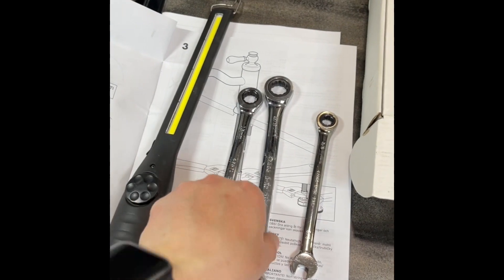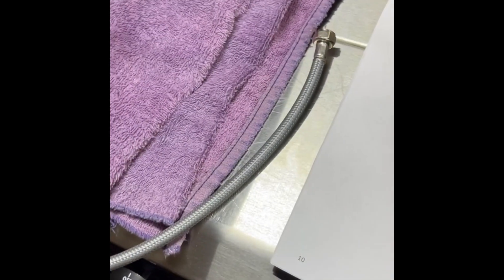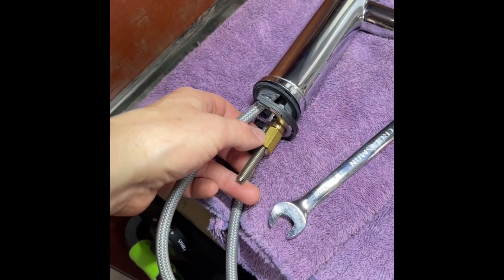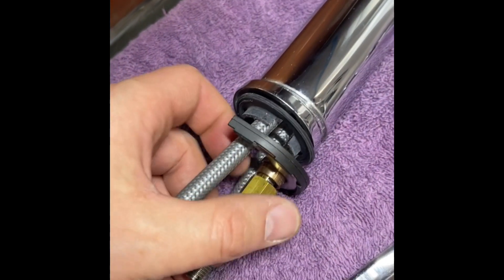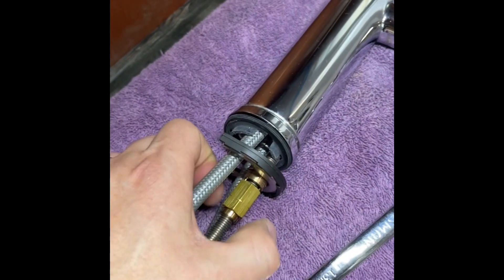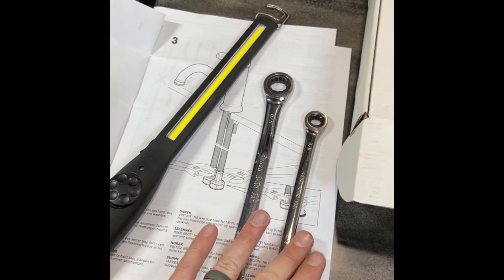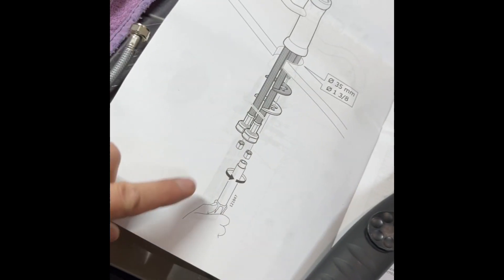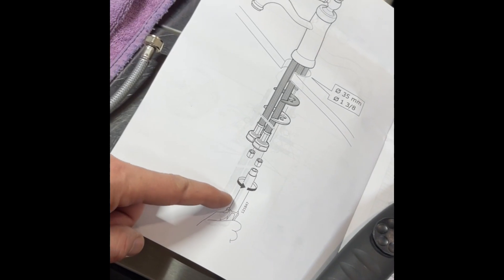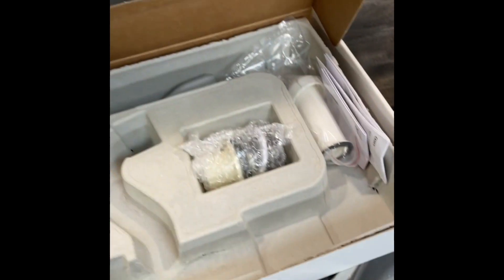Here were the tools we used to take the old one off: a five-eighths wrench for the fittings on the old as well as the new, and 13 millimeters for this nut right here. This nut is pretty nifty — when you loosen it past the shoulder, it's made to tilt and you can slide it right up and down so you don't have to thread it endlessly. It's pretty quick to put on and off — a neat design. When reinstalling the new one, same five-eighths wrench for the plumbing fitting, and then a three-eighths for the two small nuts on the bottom side. The new faucet comes with a little plastic tool, but I did not find that to be helpful because there's just no room in the Airstream to use it. You won't need to use any of the other spare parts, so you can just hold on to those as spares.